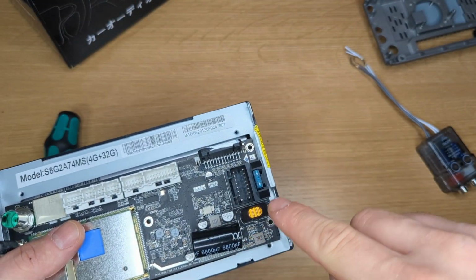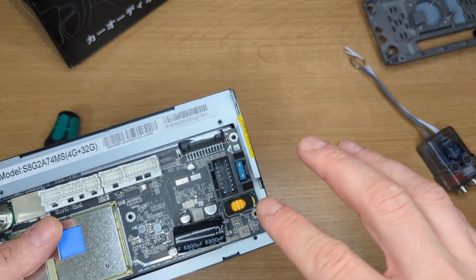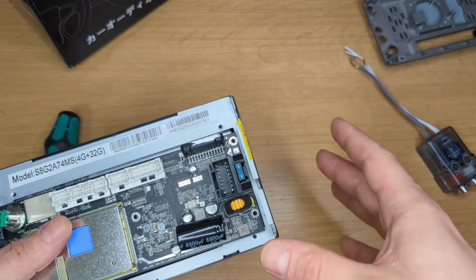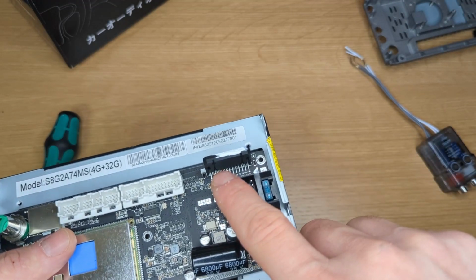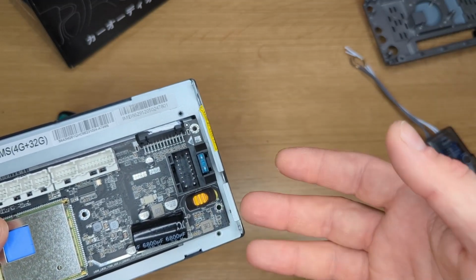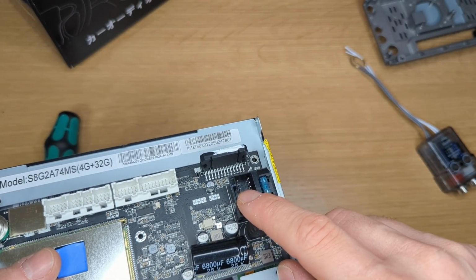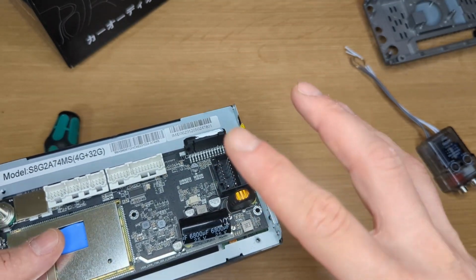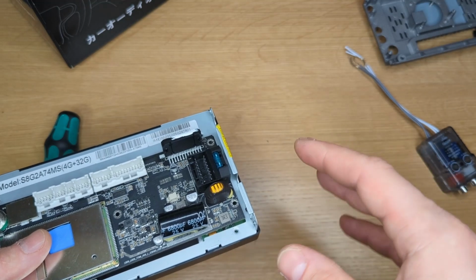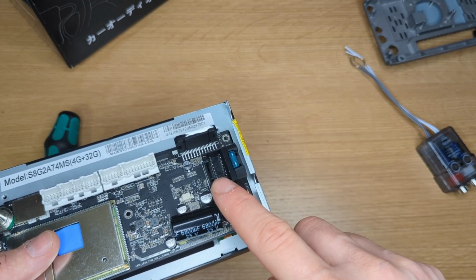Now, probably when you see this board, even if you're not familiar with circuit boards, you can tell that there's no power supply or anything, because these chips run off 12 volts or 13 or 14, whatever comes from your battery. So they cannot have a high rail voltage and they cannot supply a lot of power. And if you see on the box written 4 times 50, you can say 100% that it will never do 50 watts per channel because of the 12 volt rail.